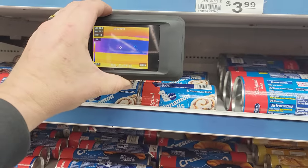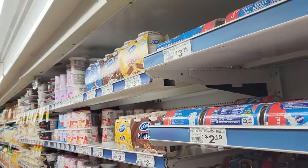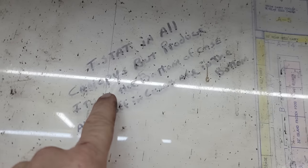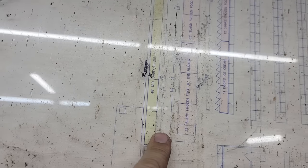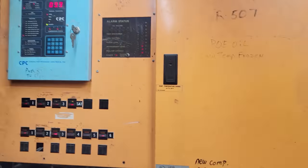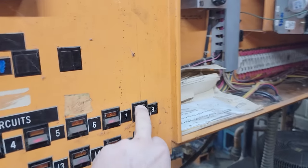You go to the back wall — you're 50 degrees back here. You come up here to the air bands, and we've got two sets of air bands on this thing. I'm going to go see if we can find the compressor room. It says here T-stats are all into canopies. We want A8, so we want rack A, circuit 8. Coming over here, it says AS — that looks like B. A8, there you go. There's 8.